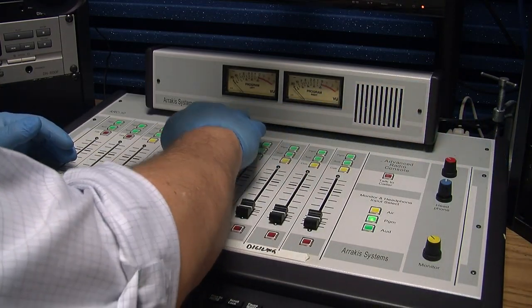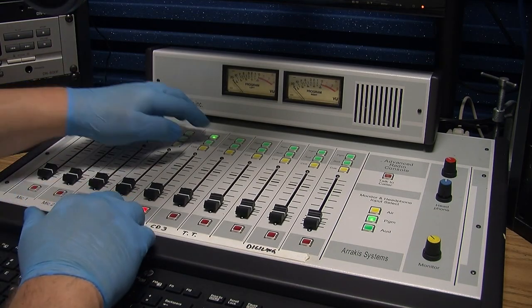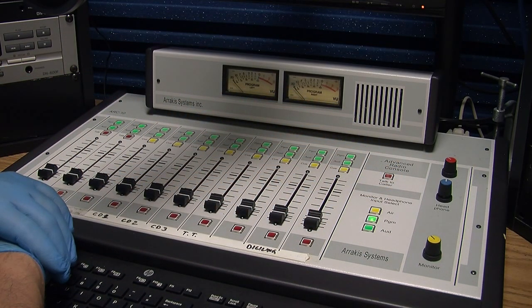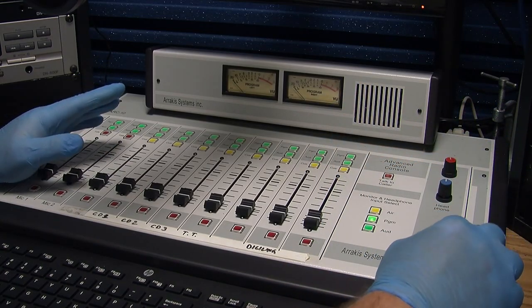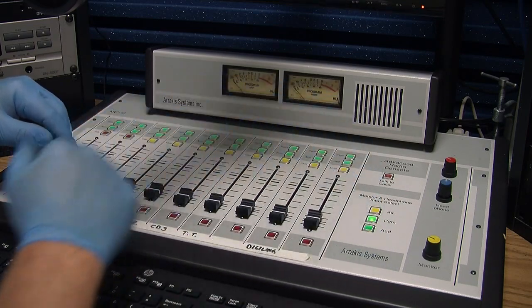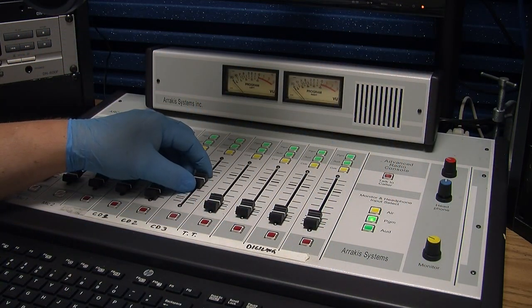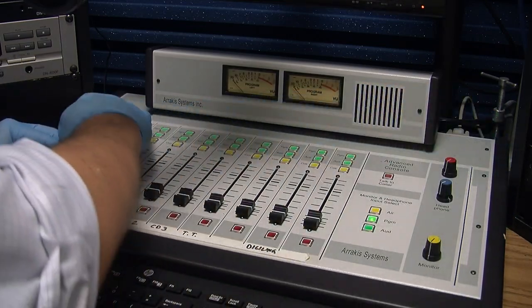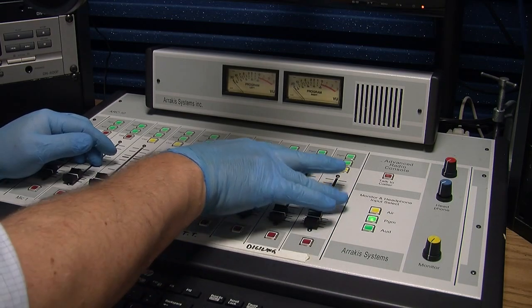Just get a basic setup, and once you think you have things set up, you should be able to hear things and move your audio internally around the board appropriately. It's always good to start with things up in the middle or less than halfway. Should things not exactly work right in the beginning — like you forget to select the proper button, forget to designate, or forget to key in — it won't suddenly just pop in and be really super loud. Once you're done, normal the board: all lights off, all faders down, all knobs counterclockwise. The only thing that won't turn off is the program button.